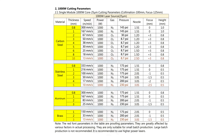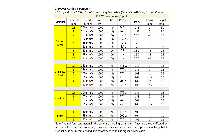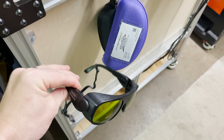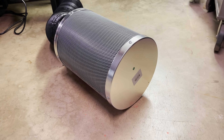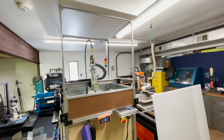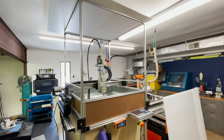I also had a lot of people asking how deep it can cut, so here are the cutting parameters for my Raycus 1000 watt laser source: maximum cut thickness of 10mm for carbon steel, 5mm for stainless steel, 3mm for aluminum, and 3mm for brass. I have also since purchased higher quality laser safety glasses, fitted my exhaust with a carbon filter to protect the squirrel cage fan, and made the rookie mistake of trying to pick up hot metal that had just been cut. I've also started building an enclosure. I continue to learn a lot from everybody's awesome feedback, so please keep it coming.